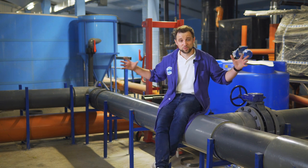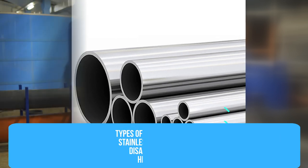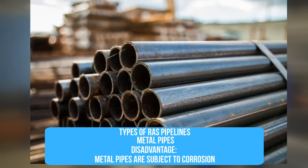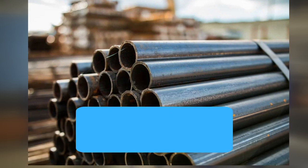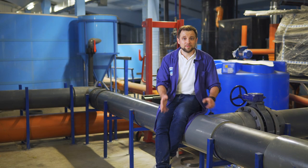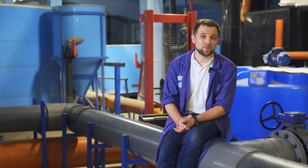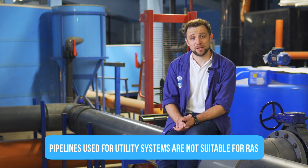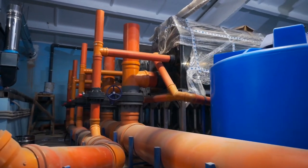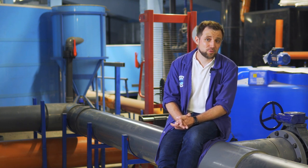There are other pipe types as well. Stainless steel is super expensive. Metal pipes corrode permanently. Cast iron pipes are heavy and also susceptible to corrosion, while plastic does not corrode at all. Asbestos cement pipes are used in municipal water supply and drainage but are not good for RAS, because RAS has very large and complex piping. You need to carefully pass through different locations and connect pipes in large sections — asbestos pipes become unaesthetic, impractical, and inconvenient.